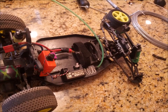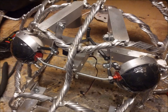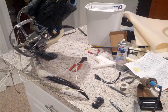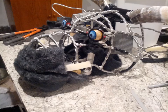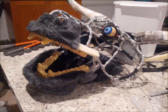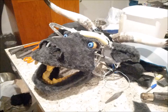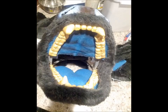For the eye and jaw movement I salvaged servos from my old RC car and mounted them both in the head — one for the eyes and one for the jaw. Then I added an Arduino and some LEDs to the horns and eyes and wired it all up. Here's what it looks like without the fur. This time I used half-inch foam under the fur to keep it soft and made sure not to restrict the movement of the jaw. The tongue is simply a blue foam camping mat that has a great natural gloss and texture.